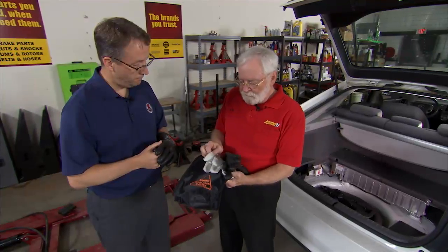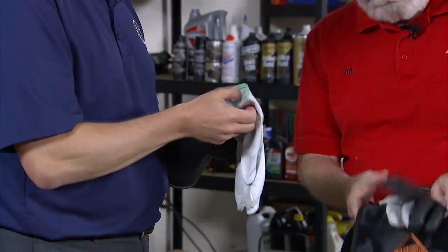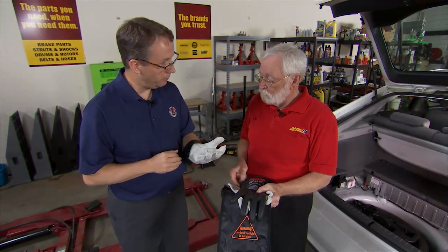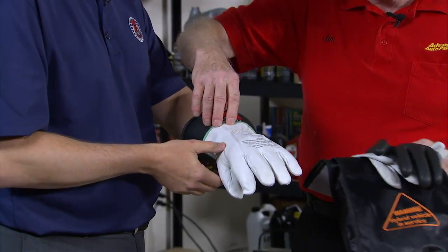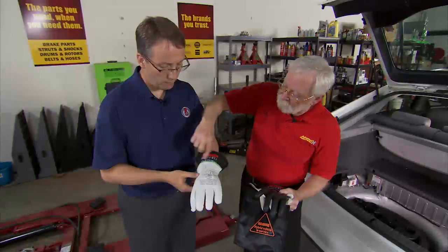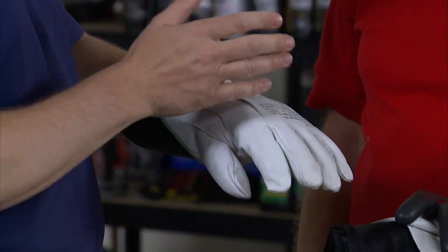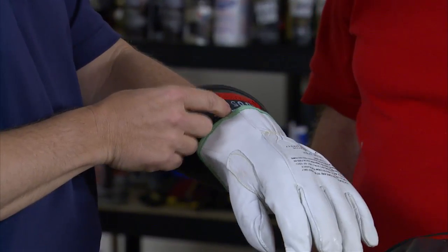You can put leather gloves over the rubber glove to protect them from damage. The leather glove is designed to be worn over the rubber insulating glove, providing mechanical protection against nicks and cuts to the rubber. Note that the rubber extends well past the leather. The ASTM and OSHA standards require that you maintain at least a half-inch clearance between the cuff of the leather glove and the end of the rubber glove for Class 0 gloves.